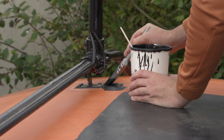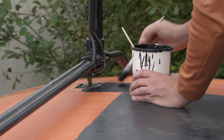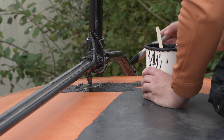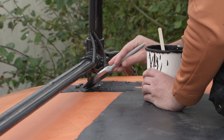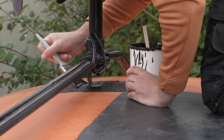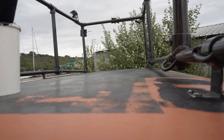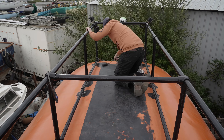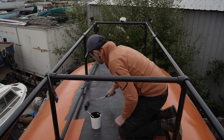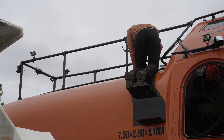I started off with a brush around all the sprinkler railing mounts and carefully covered the paintable sealant right up to the stainless steel. I'm using the spare epoxy primer I used on Alan's underside — it's tough and the non-gloss finish is fine as I mixed in anti-slip granules. I did think about having a smooth zone running underneath all the railings, as anti-slip is harder to clean than smooth paint, but in reality the whole area is going to be periodically cleaned with a pressure hose or a mop and it will make little difference. Anti-slip all over it was then. The bulk I did with a roller — I didn't really know if this was going to work with the anti-slip. Initially the gritty granules bunched up in clumps, but after a few gentle rolls it evened out nicely. The final zone up to the edges needed me to deploy acrobatic balancing skills, especially since the anti-slip isn't yet in place.